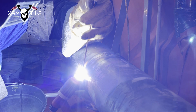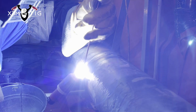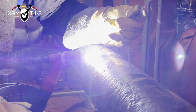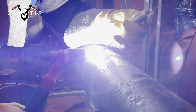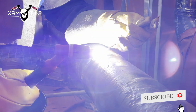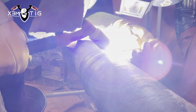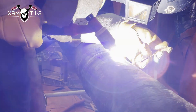That's it for needle purge. The most important thing: a really nice, proper setup — make sure the prep is nice and clean, really good dams so they won't break. Don't go too crazy with preheat so you don't burn the dams. Make sure there's no water inside so it doesn't break your dam. Always check with the lighter every time, especially on the root — check your vent hole. If argon is coming out and extinguishes the lighter flame, you know the dam is working. You can also check with your hand.